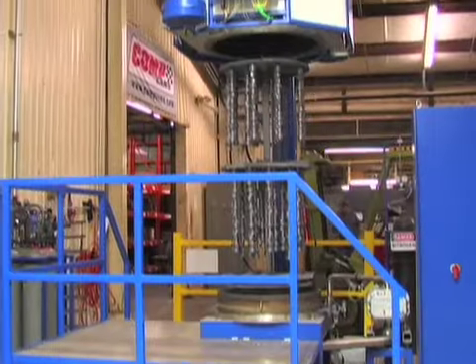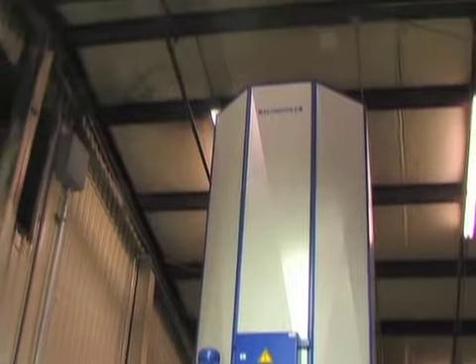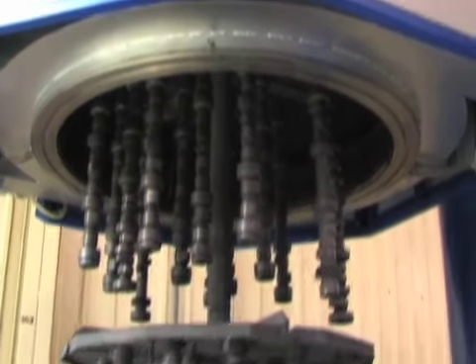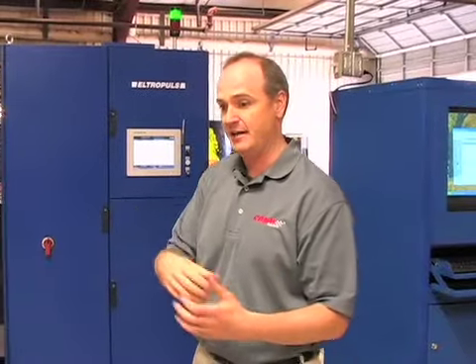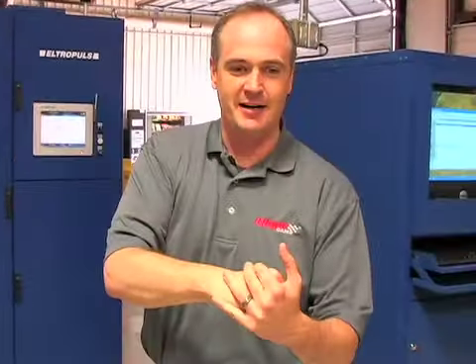What we do is the bell comes down and we suck all the air out, getting down to less than a thousandth of an atmosphere. After you suck the air out, you put some nitrogen back in. You charge the particles, you charge the wall, you charge everything and take all the electrons off the nitrogen. Nitrogen doesn't like anything but itself, so what nitrogen does is it forms these chains. As we're entering the nitrogen into the system with the cam standing there, the nitrogen just rams down into the camshaft.